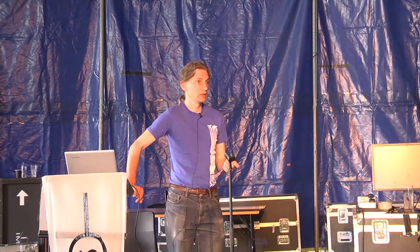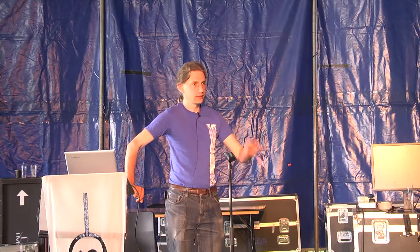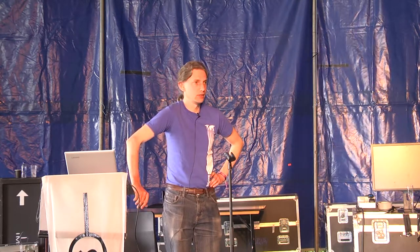The 5G stuff, there's a lot of authentication involved. It's a lot more secure, but there's gatekeepers. I see them as parallel technologies. I see 5G being a big success. This may or may not be a success. I don't know. I hope it is, but it's something cool to play with at the minute. I do question some of the commercial ideas with these, especially considering it's in ISM space. It's unlicensed bandwidth, so this is competing with things like door openers and a lot of remote controls and things like that. So it's very, very hard to run a guaranteed service on this with a service level agreement. So I don't see many consumer products using this in the near future. 5G maybe, but in terms of monitoring a switch or something, this is brilliant.